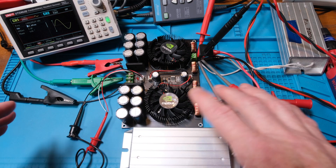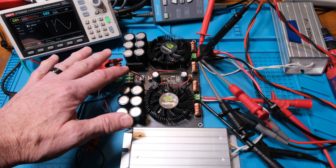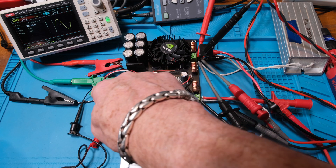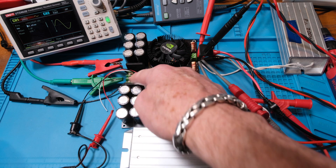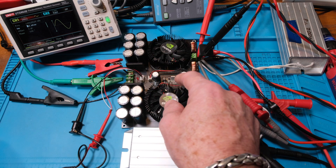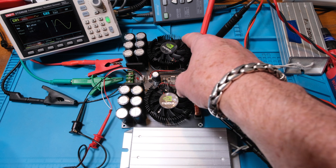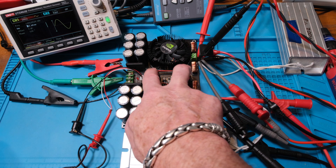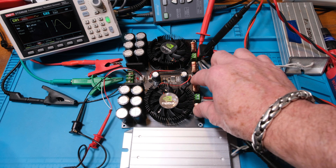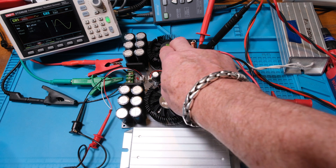A quick go-around about the setup. The input power is right here — plus, minus, return. It's DC power, so it goes to the bridge rectifiers just like AC would. The diodes direct the correct sides of the capacitors. We're only going to put a signal into this channel — the red wire here. The white wire is for the other channel. So we have our AC input, signal input, the red light comes on when power comes up, the fans kick on, and these fans work great — they keep the thing cool. The power for the fans is here, the output chokes for each channel are right there, and there's an 8954 underneath each side.